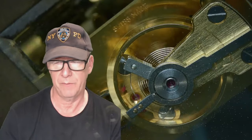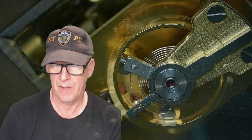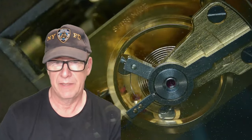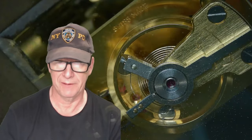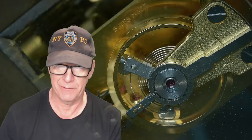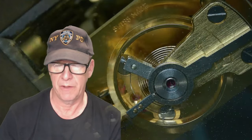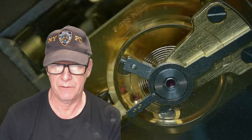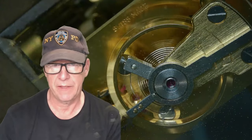Usually you see the escapement wheel on the left-hand side — that little bugger sometimes has pivots that break. People in my area come to my door with watches needing re-pivoting. I've gotten it down to 0.3 millimeter of a hole, which I think is the limit I can drill down to, and I do that on my channel.